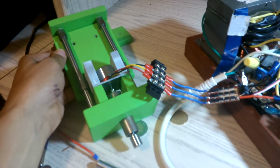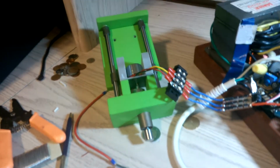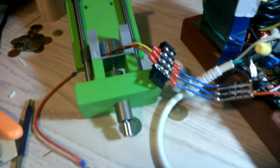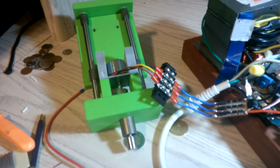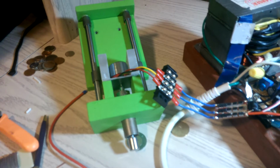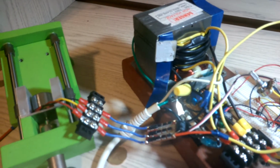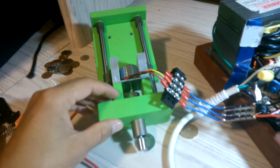So the vibration, there's peaks and valleys as the RPM goes up and down. I think the areas with the least vibration, there's a couple nulls, but the major one is actually almost at the very highest upper end of the RPM band. So probably around 40,000 is where the least vibration occurs.